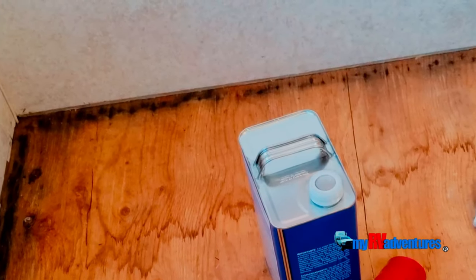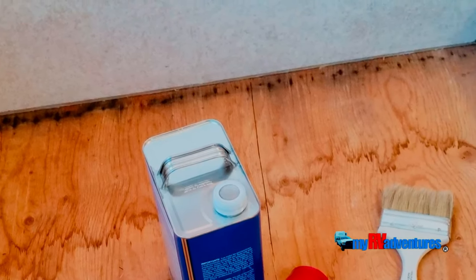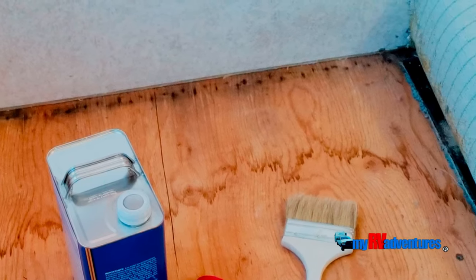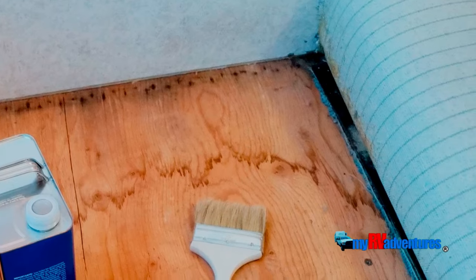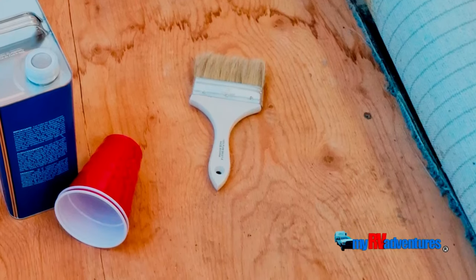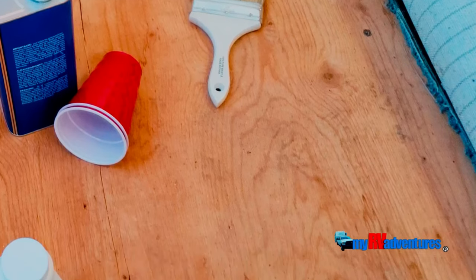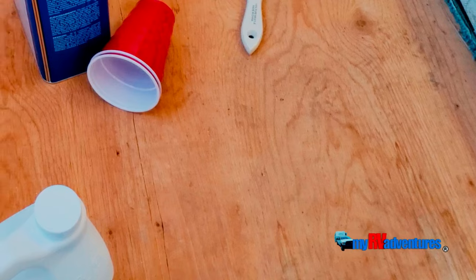What I found was there was no sponginess in the floor whatsoever. It was the people that installed the carpet who put in irregular pieces of padding — maybe about a foot or a foot and a half — with plenty of gaps in between. But I did notice some deterioration of the plywood after almost 20 years of service. Looks like we caught it in time.